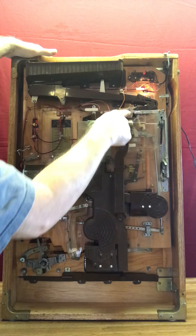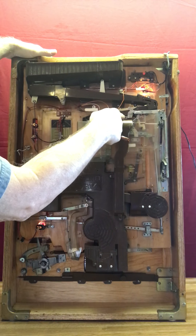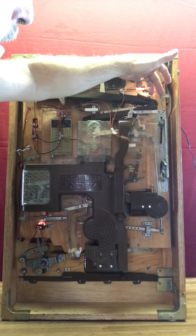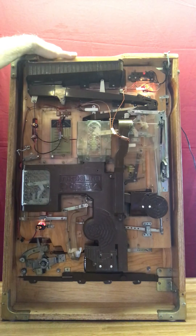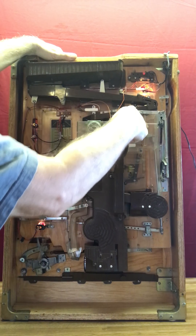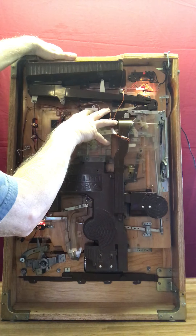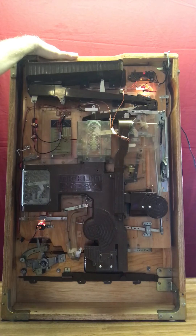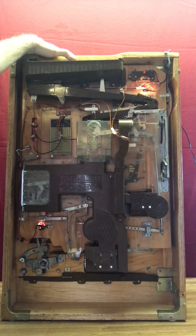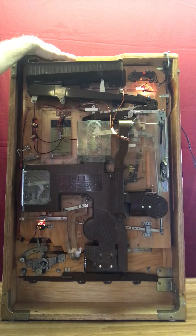When this is over and caught, it creates a platform for the balls to ride over and into the jackpot chamber. This is a maintenance function. If I were to do this, then all of the balls from this point go down this exit chute and fall out of the machine — it would only leave the balls that are in this area. It's a maintenance thing; you probably never do it unless you want to take all the balls out. So first, check to make sure that's over there, because when we put balls in, if that's not over there, they're just going to go dumping out all over the place.